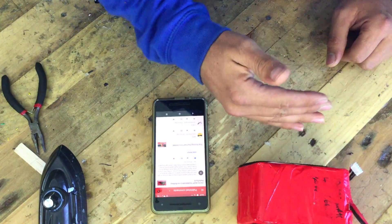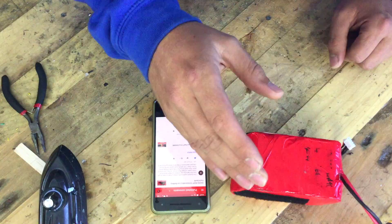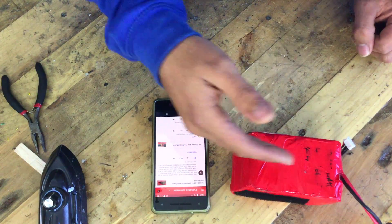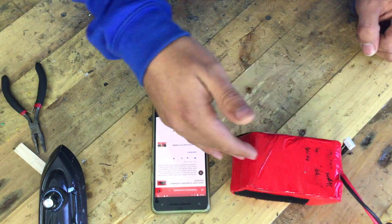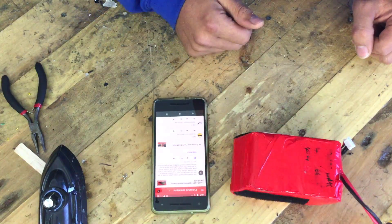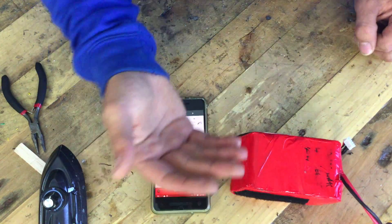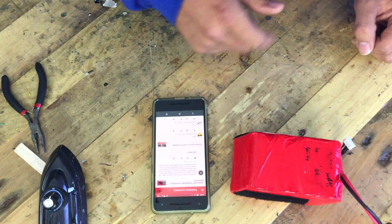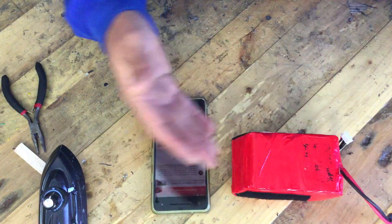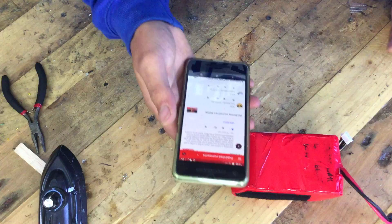Keep in mind you could run not only your BEC below its threshold, but also your ESC. You need to set your ESC to NiMH mode. If you run a 4S pack down to 12V, you could trip your ESC into a failsafe condition because it thinks it's a LiPo battery that's reached end of life — when in reality you still have power left in the pack. That's a danger if you're not close to home. So, as I mentioned in the build video, don't fly miles away on a pack like this without testing and building up to it first.